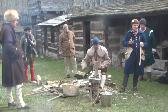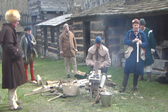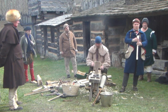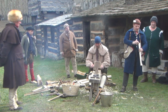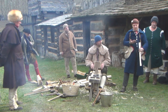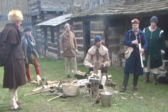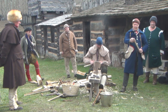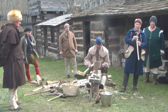I was like, that makes sense. Because on this piece of wood, if you look really close at the grain, if this were positioned in the tree, looking down at the whole cutout log, the grain's running this way on it. So according to our friend Tom, you would cut across here and wedge it out to keep that grain together. And in theory, that would keep the wood from splitting out down into here.